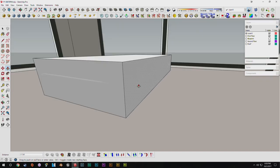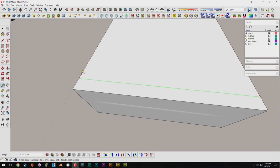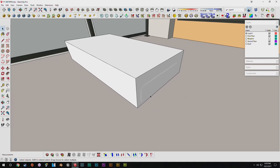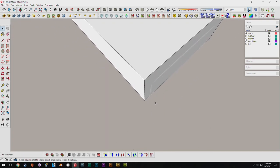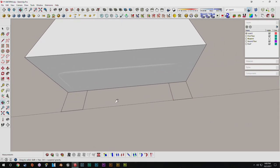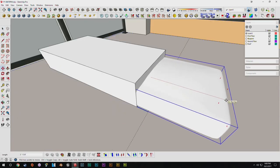I'll push these ends down now as well, trying to get an accurate width measurement. If we measure it this way, we can basically say 2'5". And the height doesn't matter so we'll just leave that where it is. We'll start pulling out some squares — maybe we'll use our tape measure, say 4.5 inches, and 4.5 this way as well, sort of squaring it off. So we can put the legs on the outside. And now we'll move the cushion out of the way — we'll drag this over about 8 feet to get it out of the way.